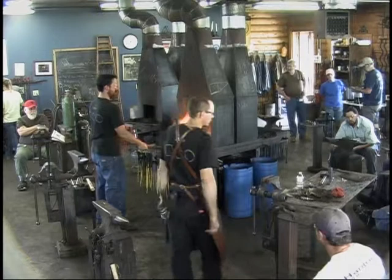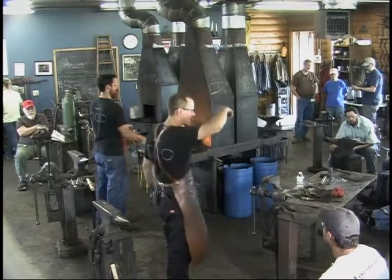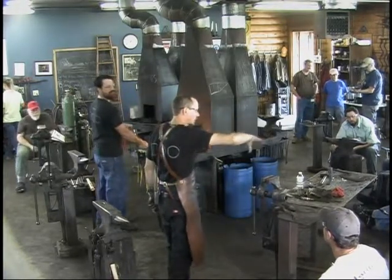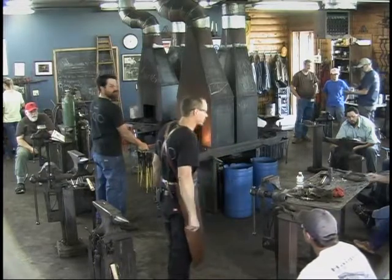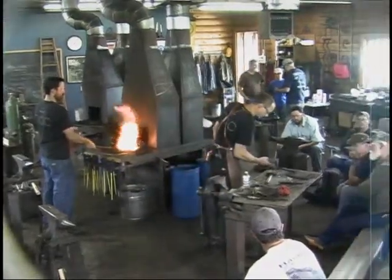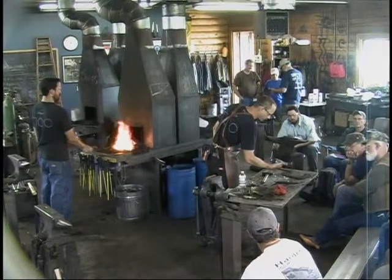Really nice. Huge amount of insulation for this little box, a small fire chamber, but that's the one I was talking about. It has two burners and they're in the back, so there's kind of a hot spot towards the back, and the port in the back is smaller than in the front, which allows me to have a hot spot, which is nice. And this one has been in vermiculite. Yes, this was in vermiculite, but that was done in the same forge and with the oxides.